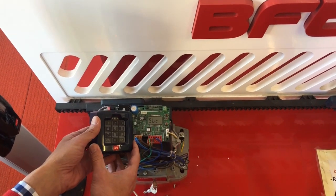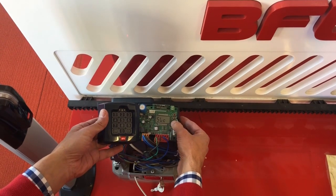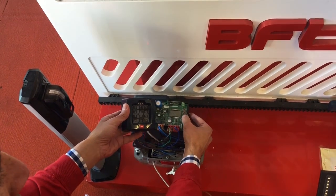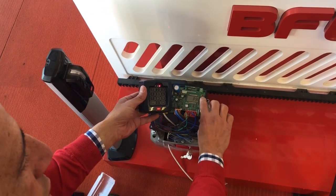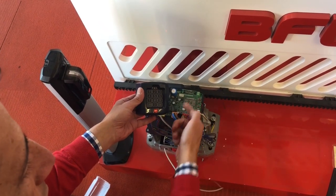Now go into your radio menu on the control board — this is so the wireless keypad will be accepted by the receiver. Hit your OK button quickly twice; the word HALT will appear. Now at normal speed hit it two more times; the word PARAMETERS will appear.